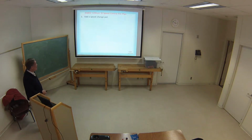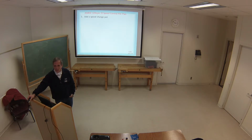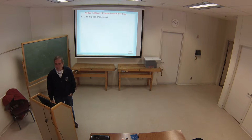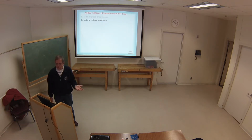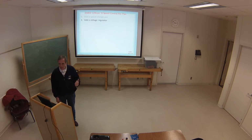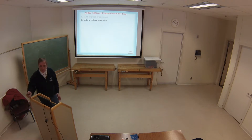But now EZkeyer 3. I kept asking what's the biggest drawback. What do customers ask for most? And they all said the speed pot. I said, speed pot? You've got to be kidding me. Why? Because a lot of the other keyers all have a speed pot. Wayne did it. Well, I said, okay, let me see what I can do. But first of all, I didn't have an A to D converter in it, so I'm going to have to figure out something. If it's going to be voltage dependent and I'm running with 5 volts, I can't do that anymore because the battery sags a little bit, and it'll change the speed. So I ended up having to change the voltage mechanism to a 9-volt battery with the regulator on the board now. A little more complicated, a little more circuitry, but I could know that I was always going to be at 5 volts.